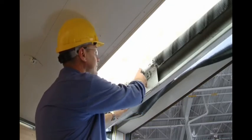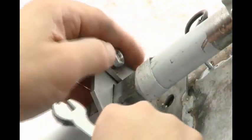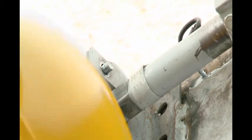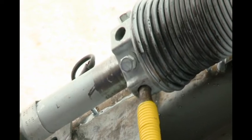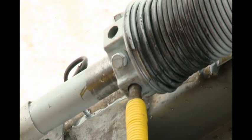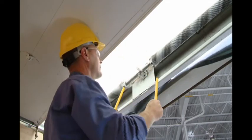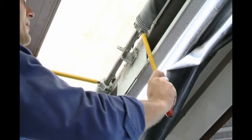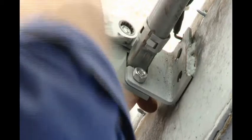Using a half-inch wrench, undo the two nuts on the balancer center bracket located at the midpoint of the Whiting balancer. A new balancer center bracket will replace this bracket shortly. Insert a 3/8 inch diameter rod into one of the round holes on the balancer spring winding cone. Ideally, use two rods to maintain the tension on the balancer spring before the new bracket is installed. Adjust tension as required. Once the desired tension has been achieved, install and secure the new balancer bracket provided in the Command Lift box.